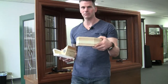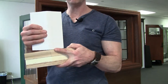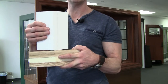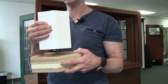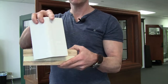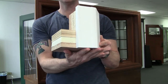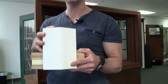This is the bottom seat board. A lot of companies, if they even have this piece, will take it and put it right on top, then just caulk the heck out of it right along here, trying to keep water from getting underneath. You can also see why that seat board would gravitate away from the wall over time, depending on how it's installed. A better system uses an overlap — I mean, it's a no-brainer. Then all of this gets clad from underneath so that nothing can come up and in. It's a completely sealed-off system.